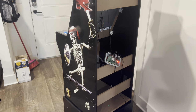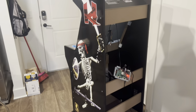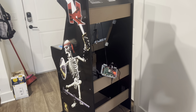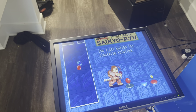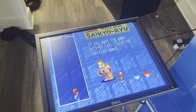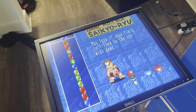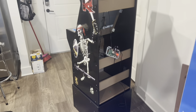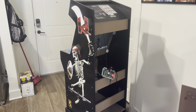The Geekworm or LVDS 1.5 HDMI did not work on Killer Instinct, and it did not work on Fast and Furious. I tested it on one more cabinet to make sure I wasn't going crazy, and it does work on Big Blue. So it is functional — it just doesn't work on the cabinets I wanted to mod. Looks like we're gonna be modding a Big Blue today with a 20-inch screen. I'm also going to try putting in a Unicorn monitor, which claims to work with Arcade1Up, but we'll be the judge of that once I pick one up.